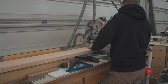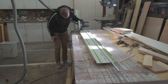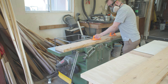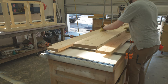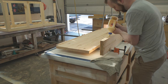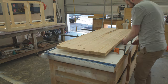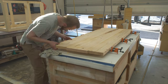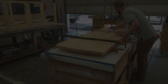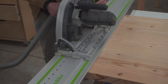Nowadays the tabletop is definitely the thing I start out with. There's a lot of waiting periods with the tabletop — with gluing up and staining and finishing all being done before installation — so if I start with the tabletop first, I can do other things while I'm waiting for things to dry. I also mill down the pieces for the tabletop differently now. Instead of cutting off the edges to make them square, I start on the jointer and the planer to get the faces flat, and then cut out any factory chamfers as necessary. Usually the planing and jointing process gets them out and I can get about an eighth to a quarter inch of extra width out of each board. I'm definitely a huge fan now of using biscuits for gluing up panels like this — not because they add extra strength, but because they help so much in keeping everything flush. I had to do a ton of extra sanding on this tabletop because things were just a little bit out. Once the glue was dry, I cut off the excess on the ends.